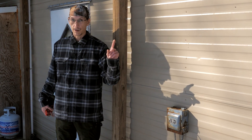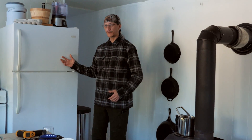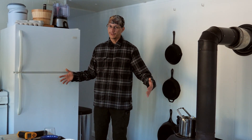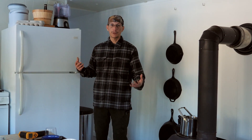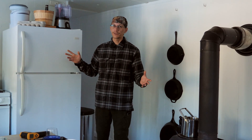Our second biggest electrical problem: as we showed in our last tour video, we have a wood stove and a refrigerator — a traditional 120-volt AC refrigerator. This is how close they are to each other, and it's a big problem. The fridge is killing our battery bank every night because it's competing with the wood stove's heat. A few options: switching to a propane fridge, but those need direct venting and they're expensive.